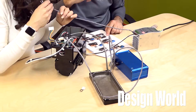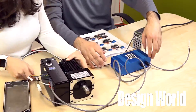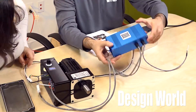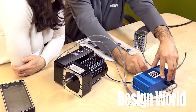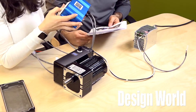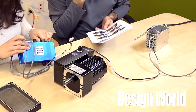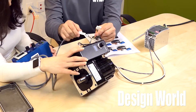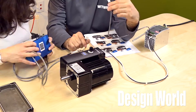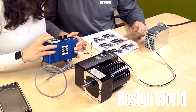Then we moved the wire harness and pot connector to the side and inserted the cable for the remote I.O. to the control. We connected the remote wiring to the controller board's J4 socket and then connected power to the 24V transformer and turned on the I.O. Finally, we turned on the enable switch, one of the remote functions, and with the forward brake reverse or FBR switch in the on position and the remote speed pot turned up, the gear motor drive shaft started to turn.